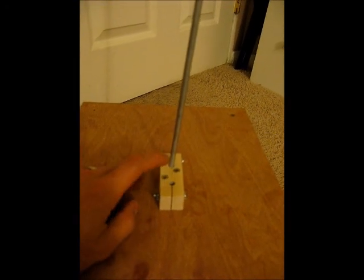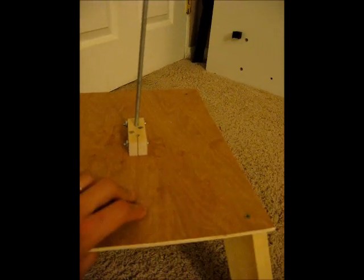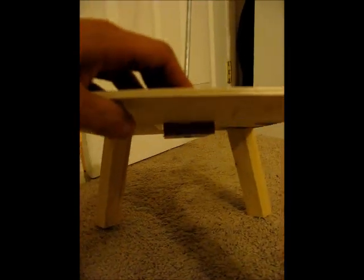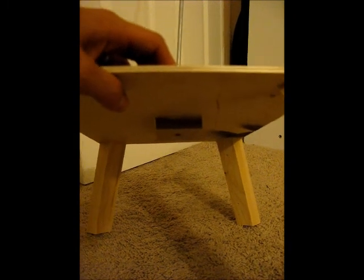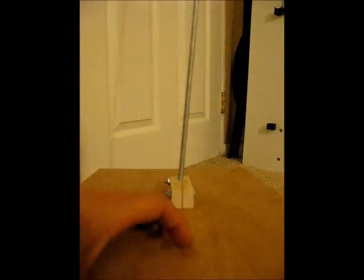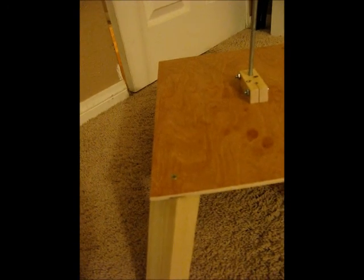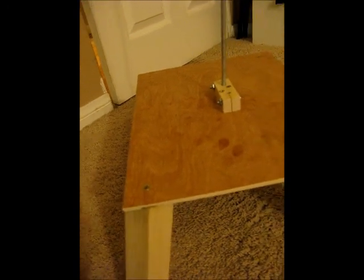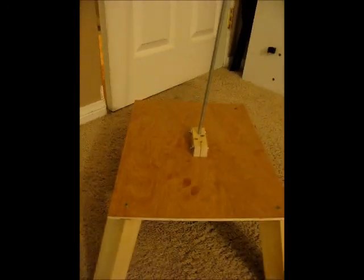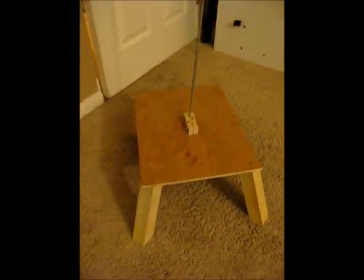To put this on the plywood, I just did screws through into the 1/4-inch ply, but on the bottom I put a 1/2-inch chunk of MDF down there and glued that to the bottom here, and then put another screw up through into the block. For feet, I just did 20-degree angles on a miter saw. I glued them on, pin nailed them first so they'd stay put, and then drilled little screws. But anyway, simple way to make an inexpensive stand.